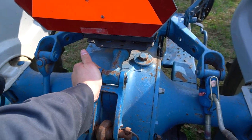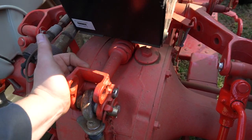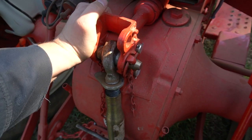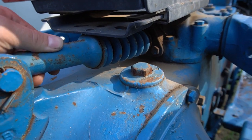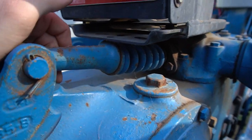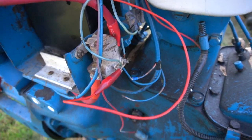One other thing to check is the draft control. There should be no play in the spring — not the upper rocker, which has some normal play for a 50-60 year old tractor, but there should be zero play in the spring itself. That is how your draft control works. There's also more of the rat's nest wiring along with another clip lead back here.